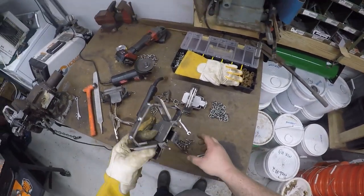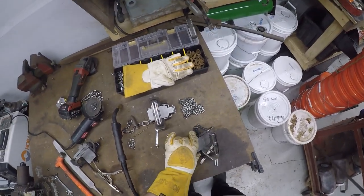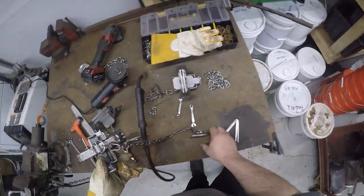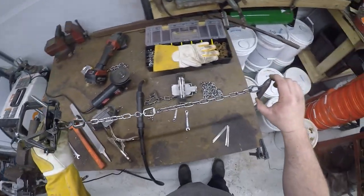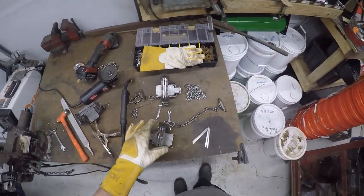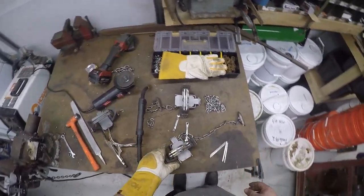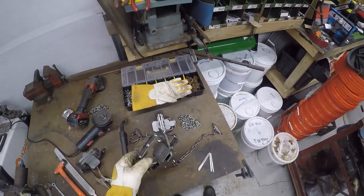All right, so there's our finished product. Laminated, jaws welded, base plate fully welded, and all of our connections welded. We shouldn't have any problem dragging this thing out of the ground or whatever. We'll come back and knock any burrs down. I'll open the jaws up and hit them with a flap wheel. That way we got no sharp edges. And that trap will be ready for wax and dye.